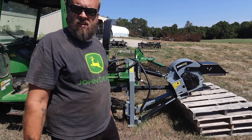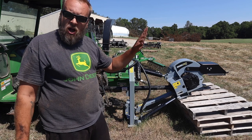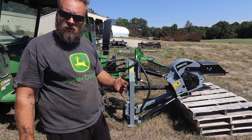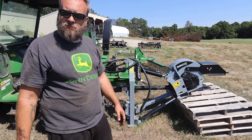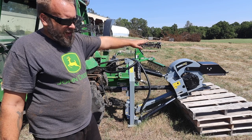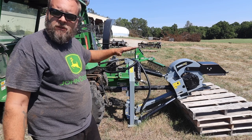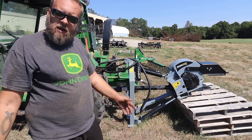So, that's one more trick I figured out. First, it was propping the end up so I get a better angle. Then telescoping stabilizers, telescoping draft arms made it easier. And then I realized with it at that angle, if I hook up the top link first and pull, I can get the bottom in easier. That was a lot quicker than any time I've done it before.